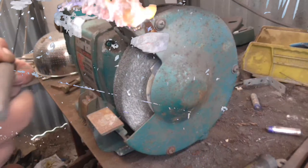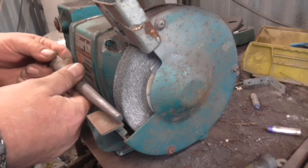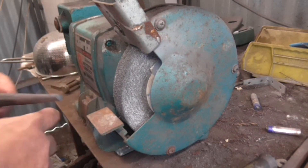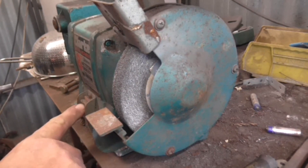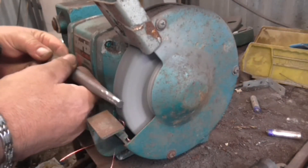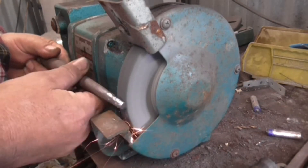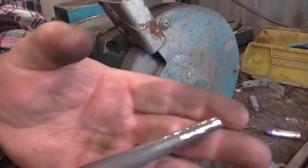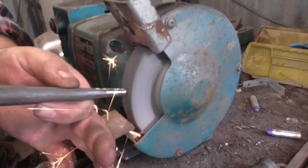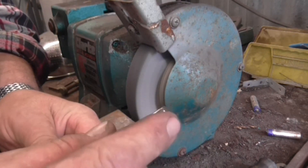Leave them to cool — that probably takes several hours. The object here is to grind the end of the punch to achieve a parallel finish, and that means rotate it before it comes into contact with the wheel. Now the object is to get a square end on it. When you've got a square end, it'll be sharp. That is sharp.